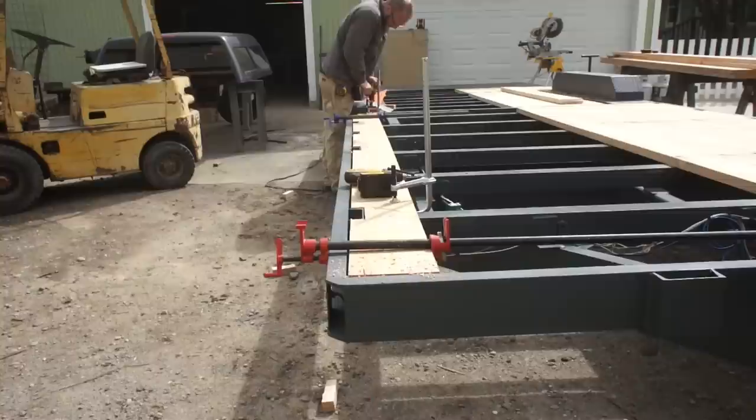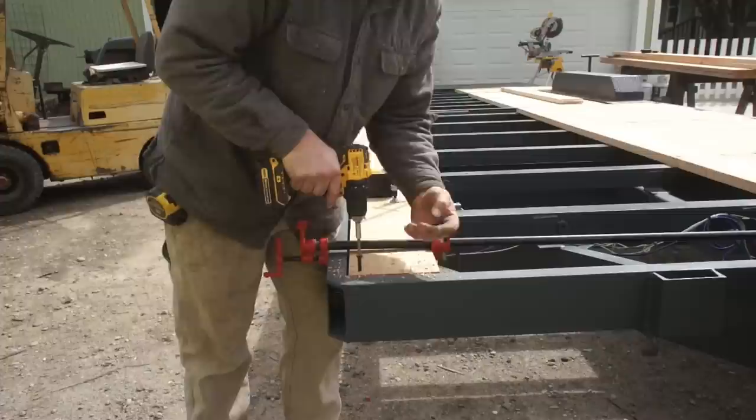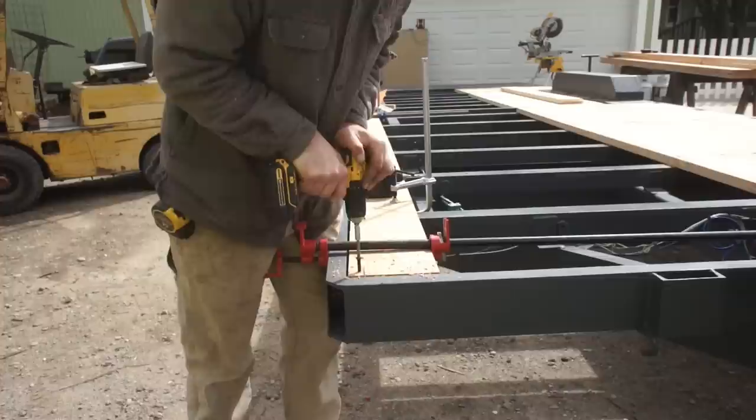When you drive these screws in, you don't want to suck them down so deep and so far that you're only getting half of the wood holding potential. Not only that, but you're going to have little puddles every time that it rains, and those little puddles are just going to absorb into that wood and rot that wood out around that screw. If you keep these somewhat flush, that water is going to evaporate out anytime it does rain instead of rotting the wood.